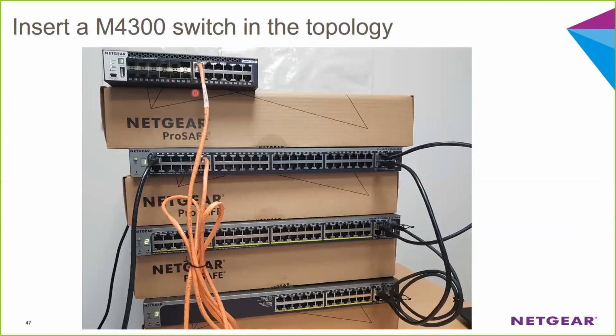You will see also that the form factor is quite different. That's a half-width switch, so that's also a good thing. You can start small in your rack with the rack mount kit. You have the big ears on the right-hand side over there, but should you want to add capacity to double the port count, add redundancy, later on you can add a second identical or 24 port copper new 10 gig switch in that same U with the same rack mount kit. Another small part in the middle comes in, and you can juxtapose, have 2 switches in the same U. So that's a good form factor.